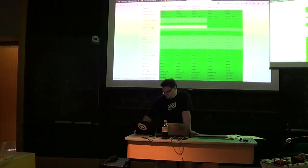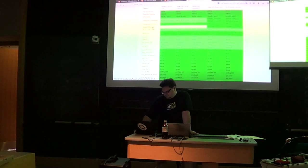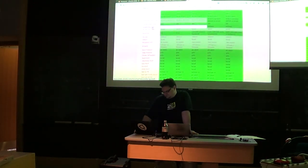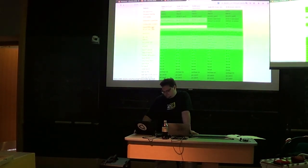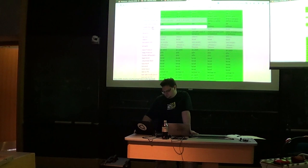There are a lot of people in the open source crypto world who consider closed source random number hardware to be scary as all hell, and would much rather have a biased diode they can read. Because they don't trust your biased diode not to be biased by somebody else. Okay, I can see that point. But the hardware implements the random number generator as a biased diode going through an LFSR. Of course it does. Yes.